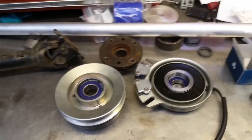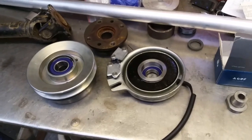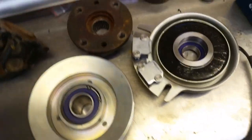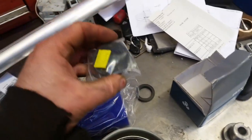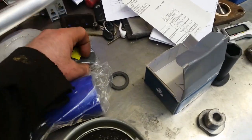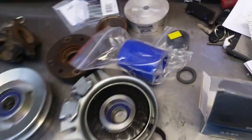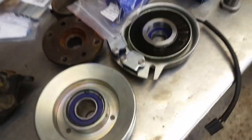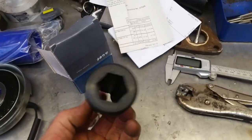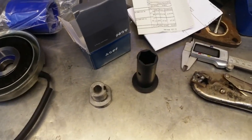Loads of little bits turned up. We've got the electromagnetic clutch here that I'm going to modify onto the back of the transfer case so we can put the flip of a switch and engage the prop. The prop we made the other day obviously. There's also a little bit that's going to make a little stern gland - a little seal and bearing into a piece of alloy tube that I'll machine down in a minute. That's going to be able to float on the drive shaft with a little silicone hose connecting to the back to keep it watertight. We've also got a cutlass bearing which we're going to machine up a little bit of tube for - that will support the prop shaft at the water end.